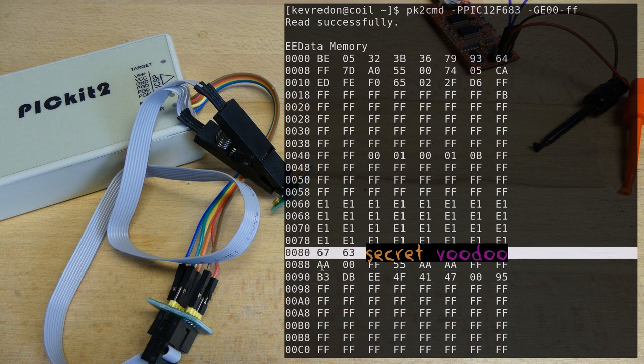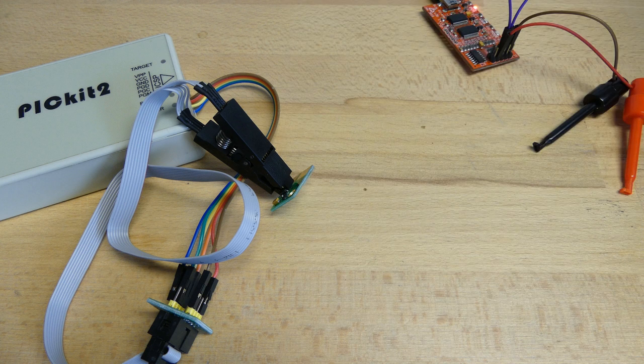And that's also what I did. I reused this ROM ID, I reused the key, and it works pretty well. And with this, we can completely change the memory, what we did, to find out where the toner level is. Now, the question is, how did they dump the key? Well, I might show you in another episode how this could be done. It is a bit more elaborate, and I chose the simple way. Take a fake toner chip and actually dump the key out of there to see if it was possible. Because whenever you hack a device, you just try to find the path of least resistance. And in my case, this was it.